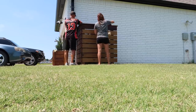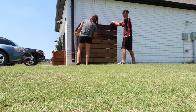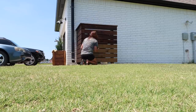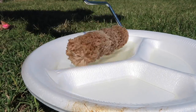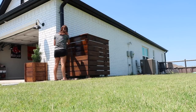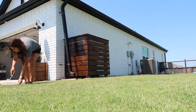While I'm working on the other side, Chase is cleaning off our white brick, because the paintbrush sometimes splatters stain on it. He was wiping that off and going behind me as I painted — it's definitely teamwork. What was funny is we got to the last two boards and I ran out of stain, so Chase had to run all the way into town just for two boards. We just didn't plan it out completely well. I do wait about an hour after staining to make sure the stain is completely dry before putting the sealer on.